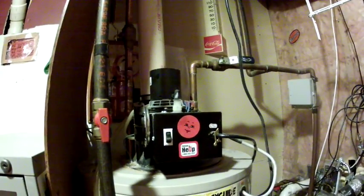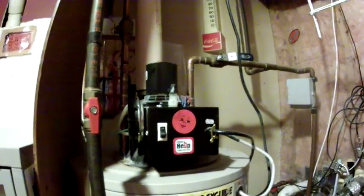This is the problem. You turn on the switch — which should always be on — it runs, and then you hear the gas line going down and hear it try to ignite. First it runs to pull air out, then there's the flame. Now it's probably going to shut off because my sensor — which tells the machine there is a flame — is corroded and needs cleaning. And then suddenly it'll just shut off.